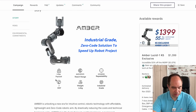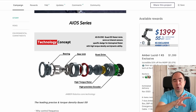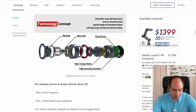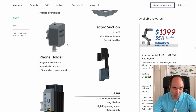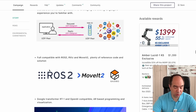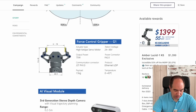As I mentioned: seven degrees of freedom, 1.5 kilogram payload, 444 millimeter reach, and a repeatability of 0.5 millimeter at all joints. It uses brushless motors, and for the reduction gearbox it uses harmonic drives at some joints and cycloidal reducers at others. Here's a picture of the quick connector for the end effector, where you can connect different tools like a suction cup, phone holder, or 3D printer head. It works with ROS2. Main parameters: supply voltage 24–36 volts, communication via UDP and CAN. The gripper payload is also 1.5 kilograms, the same as the robot arm.